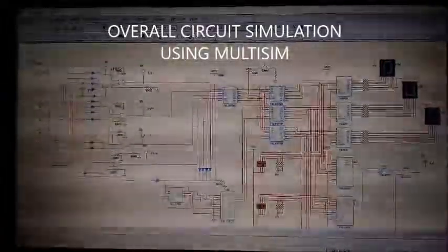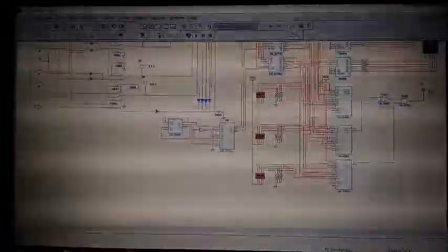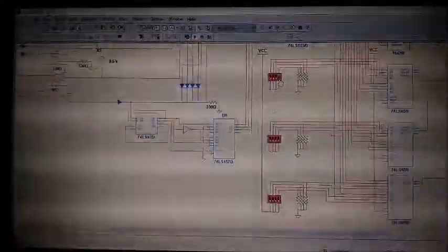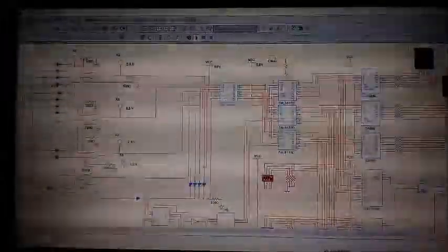The digital lock comprises a keypad made out of 10 buttons. The input numbers are saved and displayed using 3 7-segment displays. The inputs are compared with the stored numbers. And then, if the input is correct, the green LED will turn on.